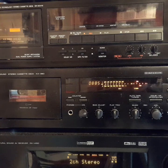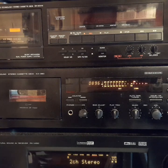Throughout the test, listen for vibrations, either from the speakers or from something in the room. If you hear any, and you're sure it's not because the speakers are being overloaded, play the gliding tone again and again until you locate the source of the problem. Don't be confused by standing waves in your room. They'll sound quite different from resonant vibrations and can cause sudden increases or decreases in the apparent volume of the tone. They can be identified distinctly from vibrations as outlined in the notes.